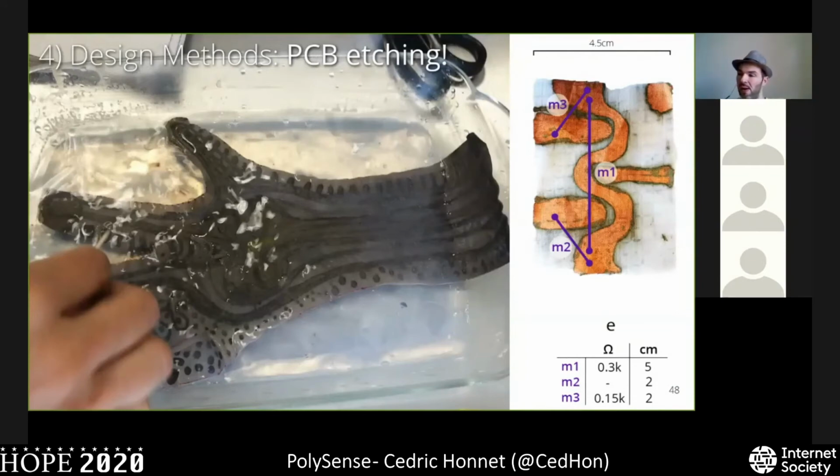Then, do some fibers totally reject polymerization? I guess like hair. Oh wait, just to finish the difference, the Eonyx is really nice. So they have 2 main kinds of textiles. One is stretchable, which is also pressure sensitive, but not as nice. The other is non-woven. So the first is kind of lycra, and the other is non-woven. It's like felt, and it has this nice Z pressure behavior. It's kind of bouncing like foam. And they have a nice range of resistance, better range than Velostat. And Velostat, as it's not textile, if you wear it, it's really like wearing plastic. You don't really want that.